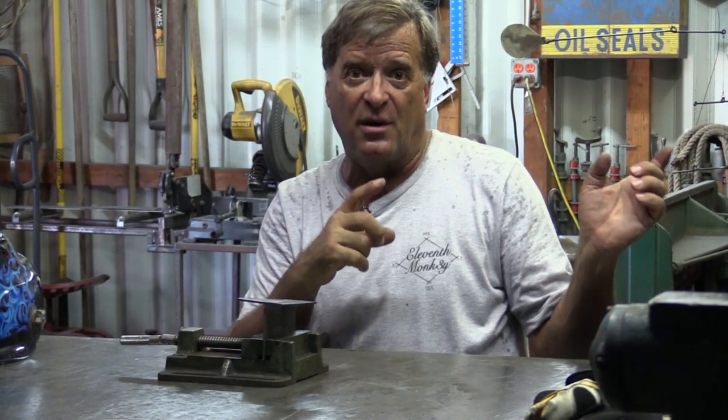So you're probably asking: which one's better, which one should I get? Personally, if I was going to take my piggy bank out and go buy a new machine, I'd look for the combination — I'd want high frequency and lift start, give me a switch so I can get one or the other. Preferably, like this machine, where it has the electronic package so there are no high frequency points, nothing to adjust, nothing to wear out.